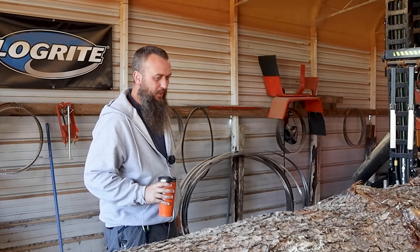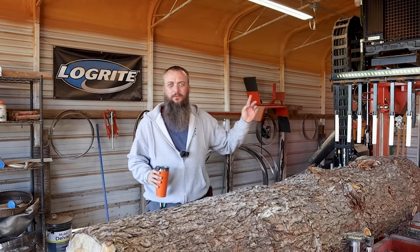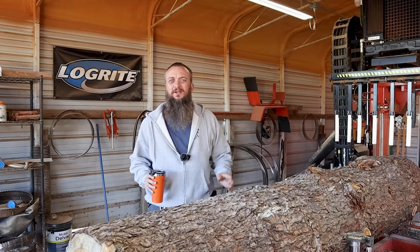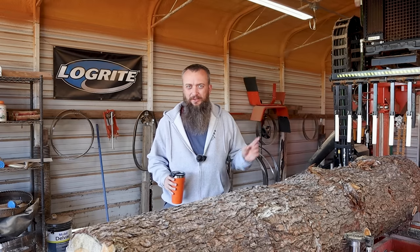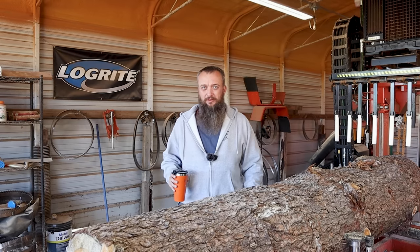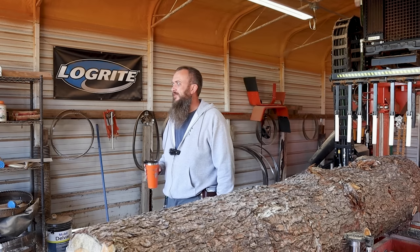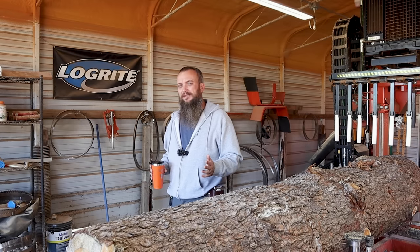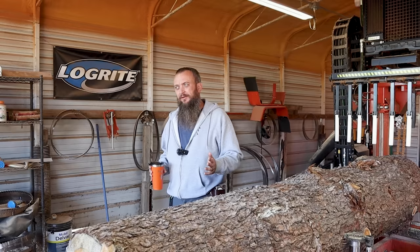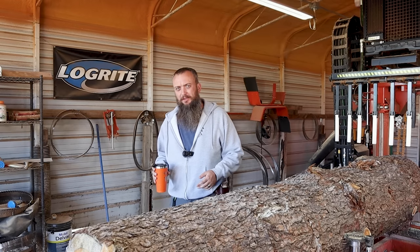So we'll open this one up, guys, and hopefully it'll be a nice log. And also, for lubrication on the sawmill, I'm running windshield washer fluid with a little bit of that cotton gin oil mixed in with it. It works pretty good. It's not as good as diesel, but until diesel prices go down, that's what I'm probably gonna be using for who knows how long, maybe forever, I don't know. Right now in Northeast Tennessee, diesel is going for about $4.90 a gallon at the gas station. The off-road diesel is still around $4.40. What are you guys paying where you're at? I'd be interested to know.